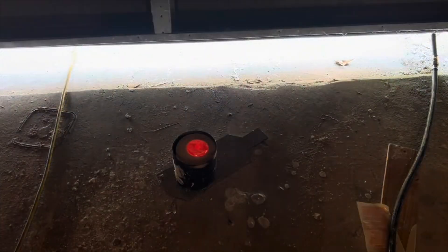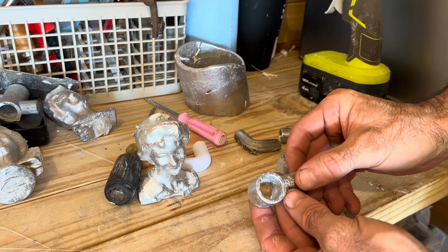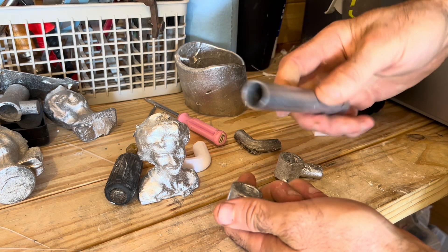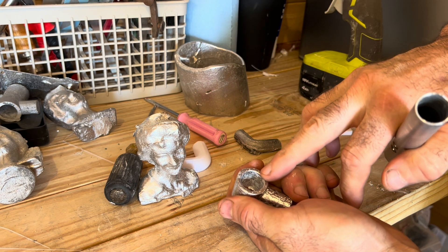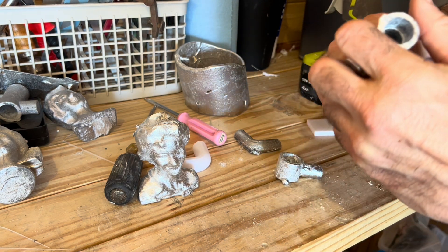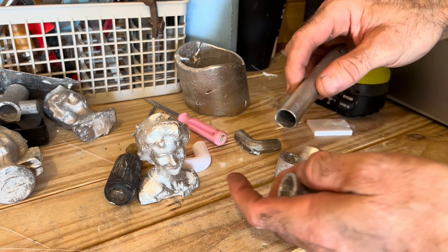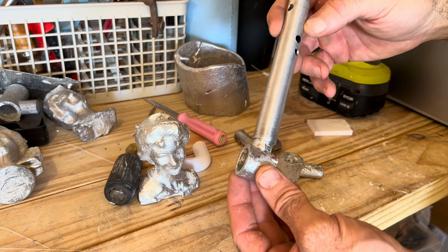So the aluminum that we're casting is still hot, but we kept the mold hot as well — it's 500 degrees. Here's what the parts look like after we've cast those. I've still got some cleanup; this is where I cut the sprue away, so what I'll do is take a Dremel and clean that out. You can see on this open end that hasn't had any cleanup that the three-quarter inch tube fits in there, and that's what we were shooting for. This was set at 0.80, so that's how much shrinkage we've had. Some of that just needs cleanup, so it's the right size. This was set at 0.66, but this is 0.62 — that's how much shrinkage happened there. But that's what we wanted: a fairly good fit, and that's without any cleanup.